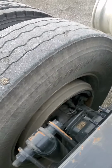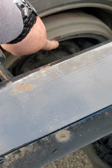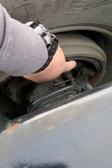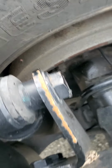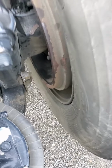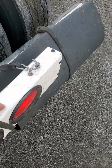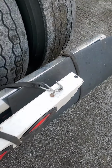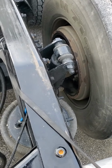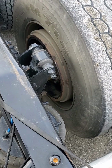But anyways, man, your best thing to do whenever you have a frozen brake drum or a pad stuck onto a brake drum, take WD-40 or liquid wrench, and you got to spray the whole entire length of the pad, and then you really got to spray it on the drum so that you can see where the drum's all wet down there. Say my hand is the brake pad, right? What I do is I spray it on the drum so gravity brings the oil down, and it kind of gets between the brake pad and the drum. Anyways, finally released, and then sometimes you got to beat it with a hammer.